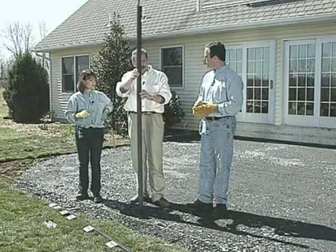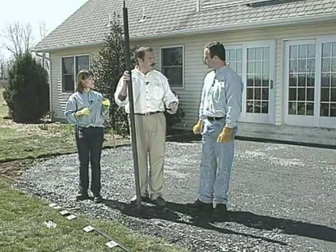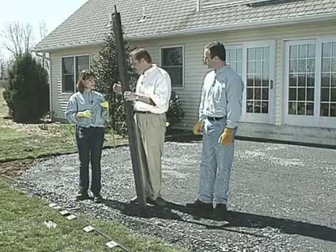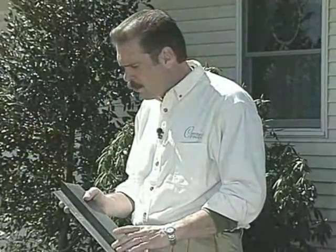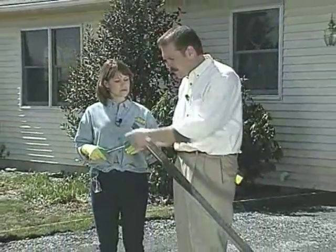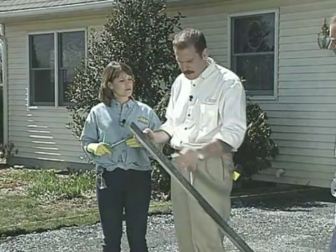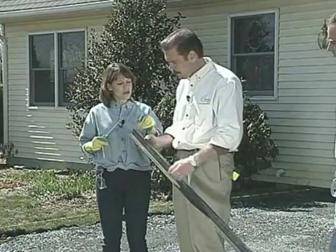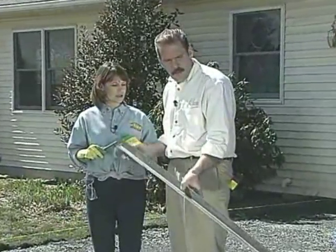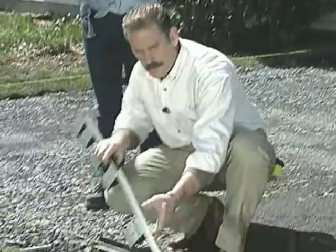Paving restraints are utilized in any area where there's not a foundation wall or an existing concrete curb or a granite curb. So there are 3 sides of this patio where we're going to have to use the edge restraint. On this patio project, we're going to be using a high-impact PVC edge restraint designed specifically with a bottom lip here to confine our sand setting bed that we're putting in the next step inside the patio area. How long is this edge restraint? Cheryl, they come in lengths of 7.5 foot. They're made in a rigid piece and in a flexible piece for going around curves and serpentine areas.